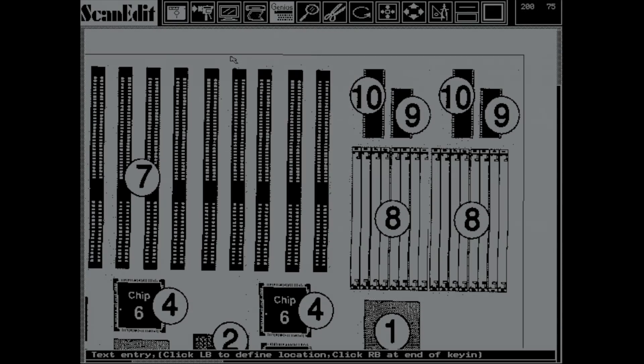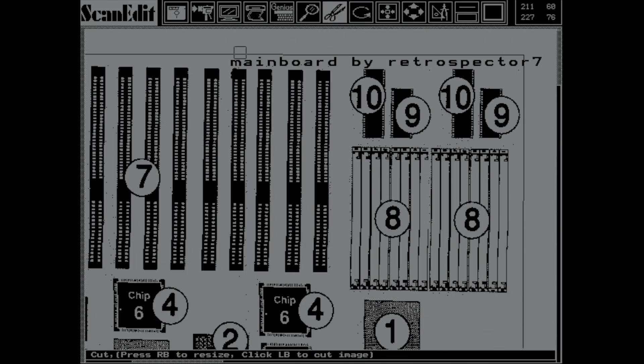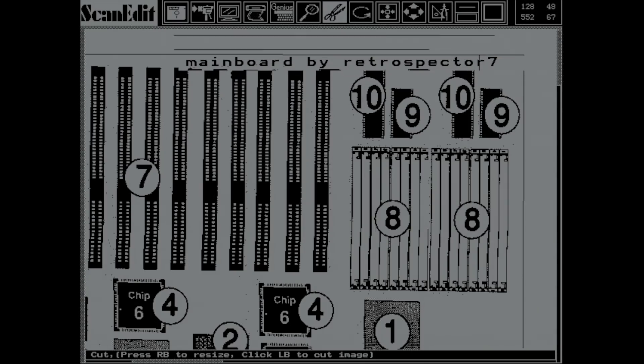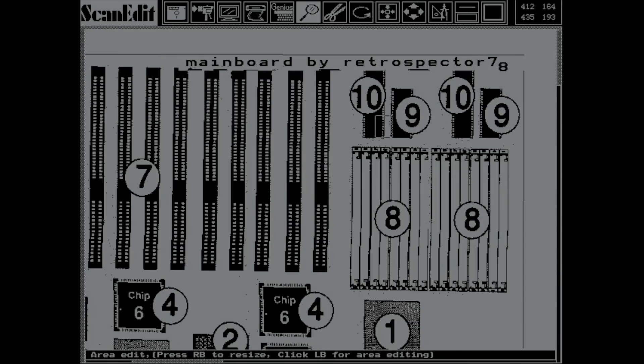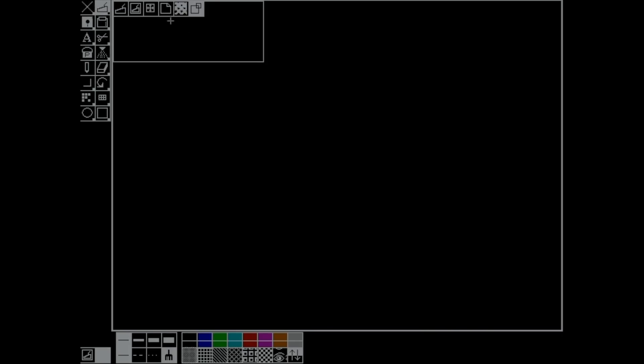Let's add some text on the silk screen. However, I find I've moved the text too far to the right. Because everything is a single layer, when I try to move the text I just created, it moves all graphical elements within the selection — including a small vertical line. I also can't change existing text, so to add an '8' I have to add another piece of text which immediately becomes part of the single-layer image. Finally, I need to touch up the letter R to remove the vertical line that was copied along with the text.